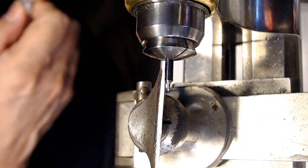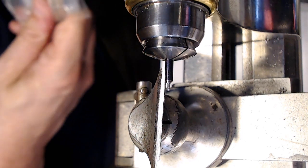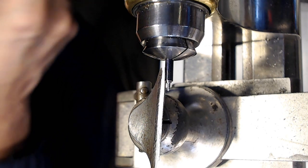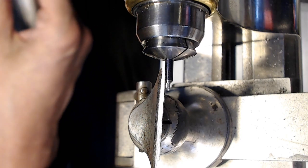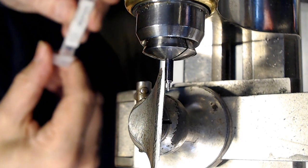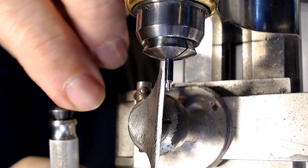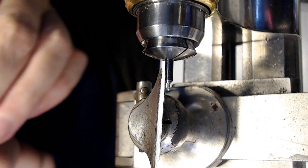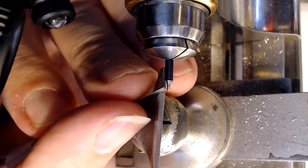There we go. Now I'm going to flip to my round graver, I think the two, this one here. So that's flat. Two round is what I want to do. I've got to get it down low enough so I can start using my pivot file. I just want to get it down to pivot file distance. So I'm going to put the graver in here like this. I haven't measured the diameter of that pivot yet. I'm going to in a few seconds. I'm going to take the other one and see if I can measure it using that one.